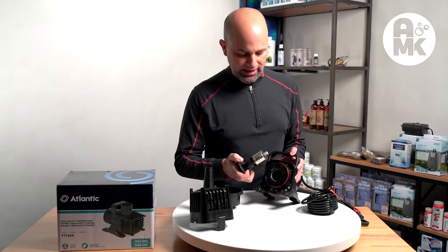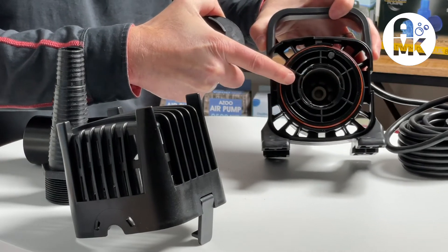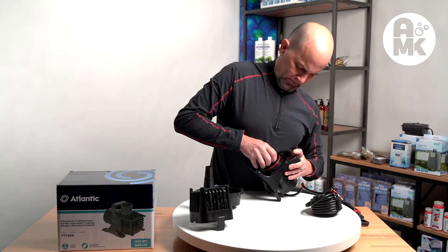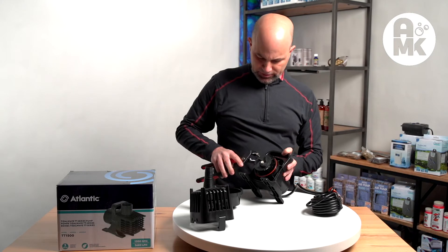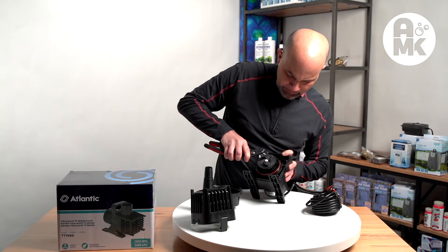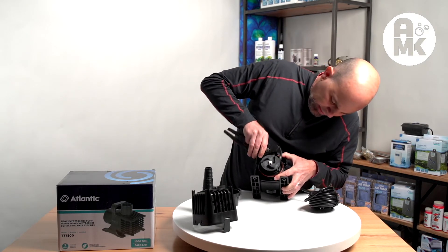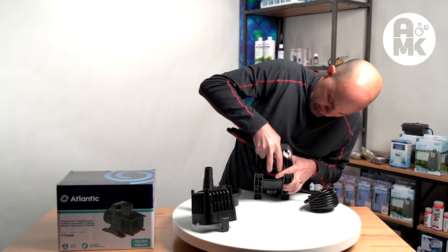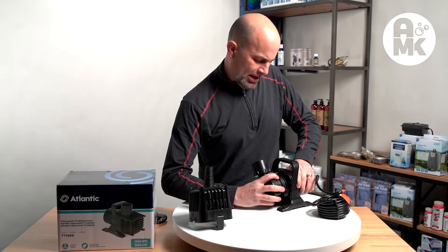Be very careful when you go back in on these big pumps — you can see the ceramic and the stainless steel on the backside. Once it's in place, I did this with a pair of channel locks. You just turn it and lock it. You're not really gripping with it; you're more pushing with it. And then this front rotates right back on at that point.